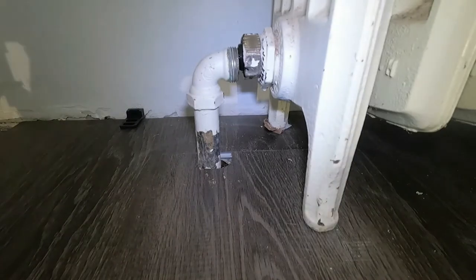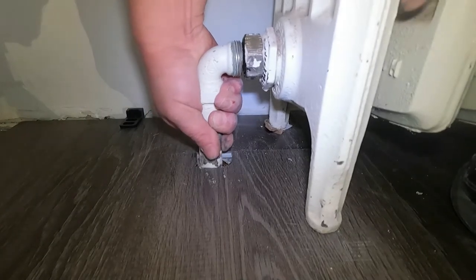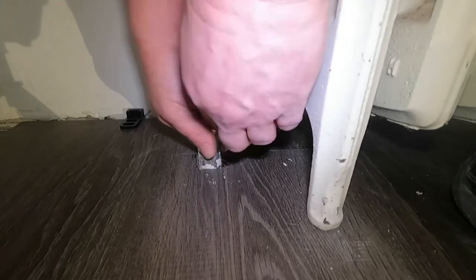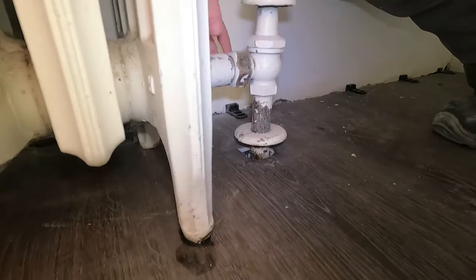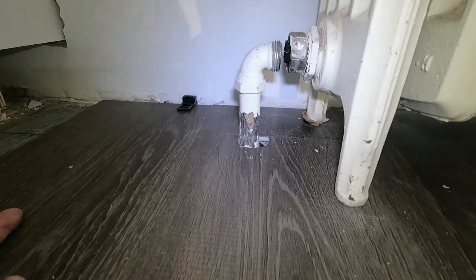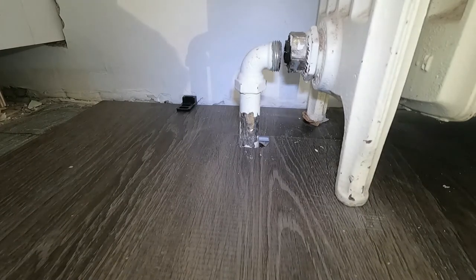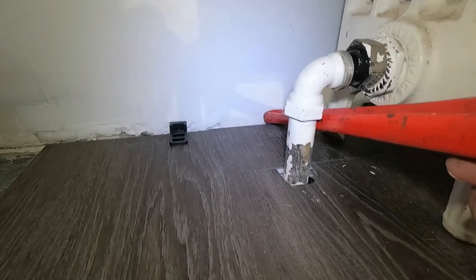This is on a second floor, so we don't have access to the basement. We're a little bit limited on how we can push the pipe up. If it was in the basement, we could just put a jack underneath it with a 2x4 and gently raise it up. Here we don't have that option. The supply side hooked up easily — it just went back together, we pulled it right up and tightened it up. On the return side, we're going to need a little more help, so we need to figure out a way to raise this pipe up, line it up, and get it started.